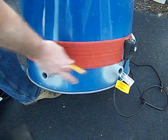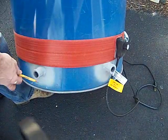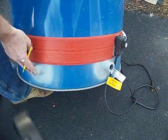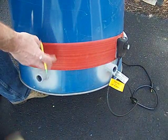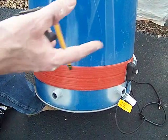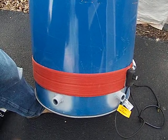We've welded three-quarter inch couplings. They're two and a half inches up from the bottom, 12 inches apart. They're good for life. With the welded-on couplings I can run my drum band heater right up against it and not have to worry. With this one you're going to have to have access to a welder or someone to do the welding for you.